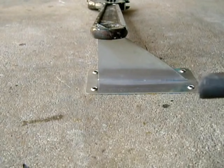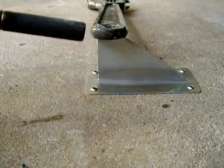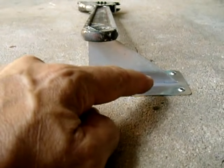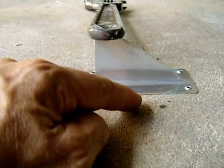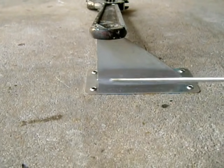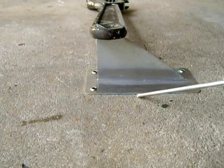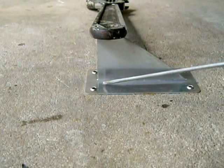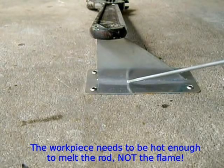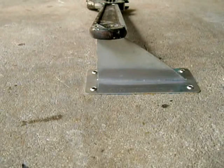I've got the torch going — hard to see the flame because of the light. You're not going to put it on too high. Now the thing with aluminum is if you overheat it, it's just going to melt into one big blob and fall apart. So first you want to heat it up, then wire brush it one more time, then gradually apply heat. This piece is thicker than this piece, so you want to put most of your heat on the thick piece and let it transfer over to the thin piece. Then keep checking by just moving the rod lightly, and when you see it's starting to flow, ease off on the heat.